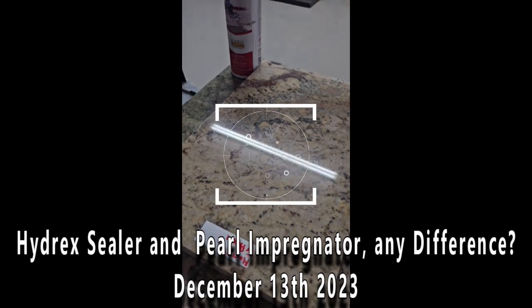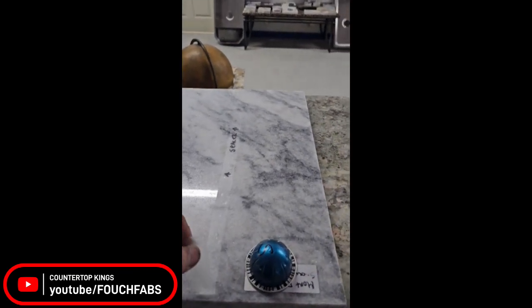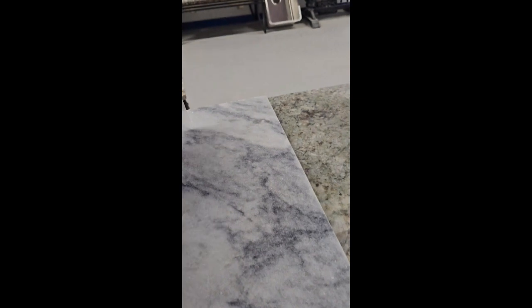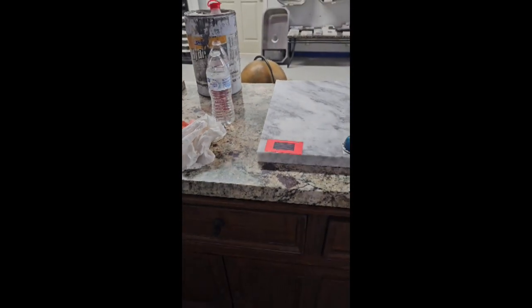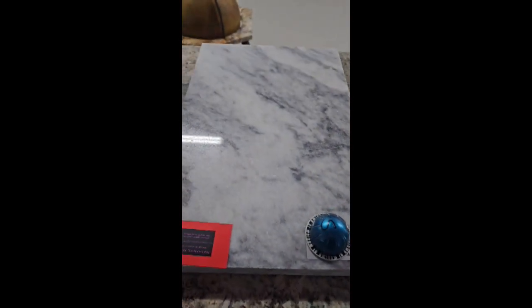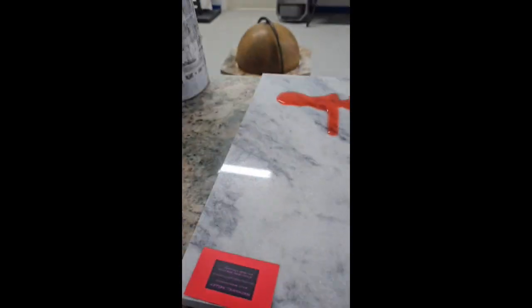I just ran a short with this one. I'm going to pull off this piece of tape so that we'll have an area that doesn't have any sealer or impregnator on it. I'll be honest — I didn't even see that area get wet over here. I cleaned both sample pieces with denatured alcohol very good before I started the process. Unless some of it bled into that little area, that area didn't get wet either. I'm going to do the same thing on this one — use some of this water with a flavor packet mixed in, probably cherry or fruit punch. It's running right up that area, actually following that area that didn't have any sealer on it. You see that?